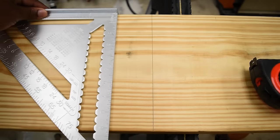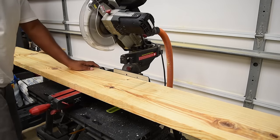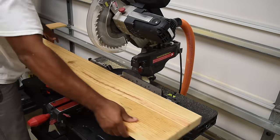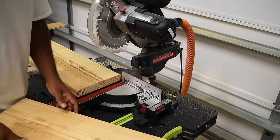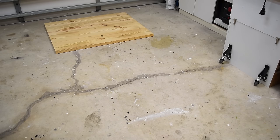In this case it's 4 to 7 inches long. Once everything is all glued together, later on I will go back and square up the door. Normally when you purchase these boards they have moisture in them, so they're known for shrinking. I left them outside for a few days to dry, brought them inside, and let them get accustomed to the humidity in the house. A circular saw or miter saw works well for cutting this lumber.